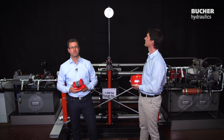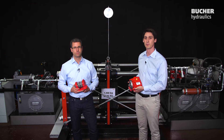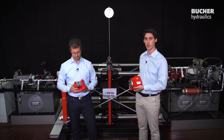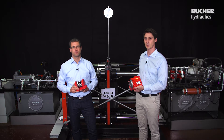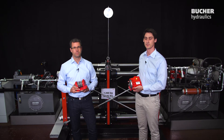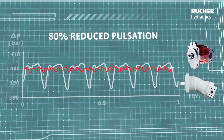A pendulum like this is easy to realize with the AX displacement unit because the AX translates every RPM commanded by the control algorithm precisely into volumetric displacement, no matter the pressure, direction or other circumstances. Also its flow ripple is tiny thanks to its 24 pistons.